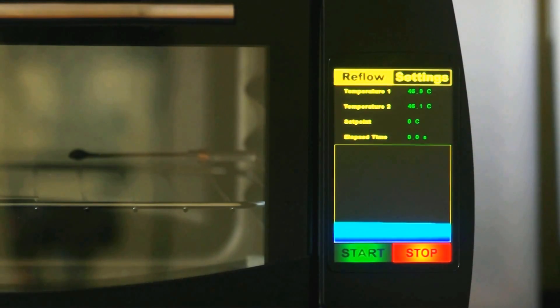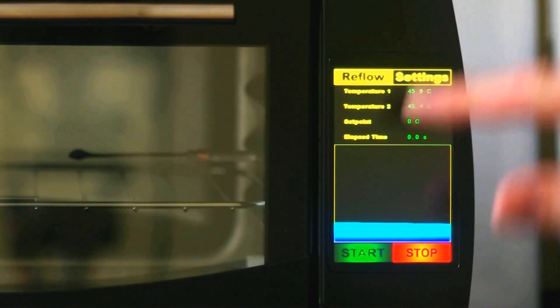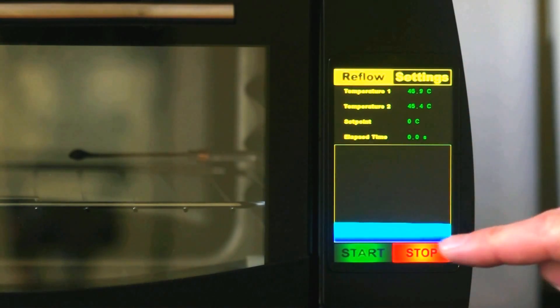This layout uses two layers. This screen uses two layers — one is the whole screen at 800 by 480. Because the screen is so large, I'm using a lot of SRAM and I don't have that much left. So I have one buffer for the whole screen and a second buffer for this graph on the second layer.